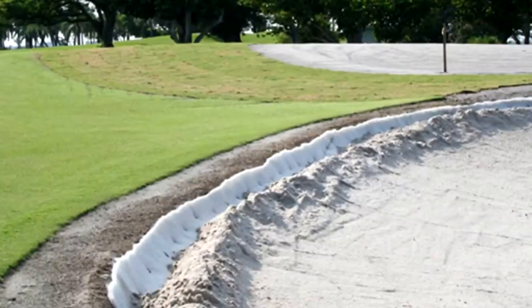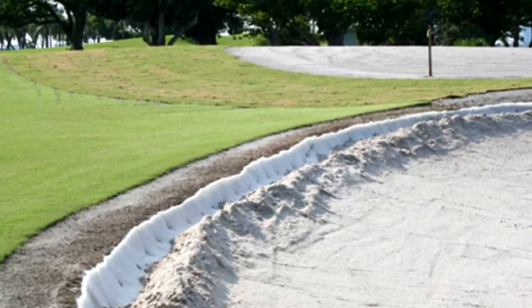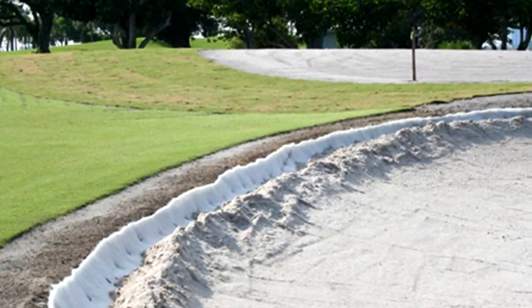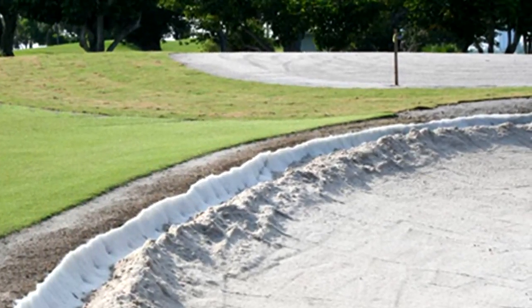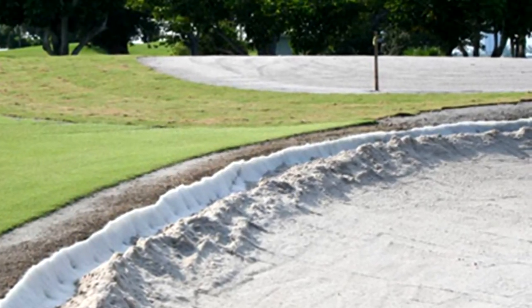And along the edge of the bunker there, sand has already been placed in, but the details aren't finished in this photograph because the geotextile fabric comes up, and the Bermuda sod will go down over the edge, and it can root through there. But they will then edge just inside this liner in here. So that works. You can see the work going on.